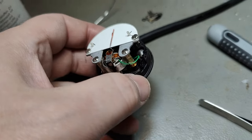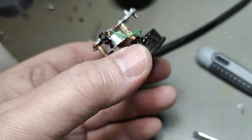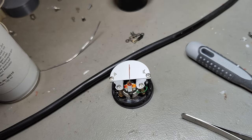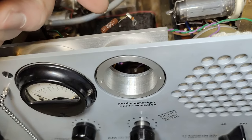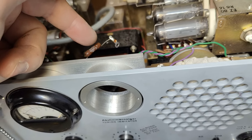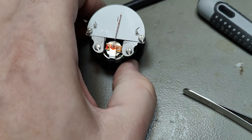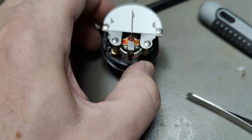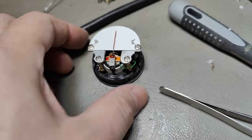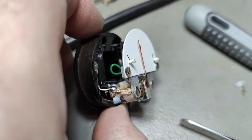It took a few hours but it was definitely a lot of fun. I think I got all the internal parts from the other meter in here. The only thing is that sensitivity is now about three times as low - not a big problem. All I do is change this 100k resistor, because I measured plus minus two volts on that side. So if I change the 100k to 22k I will now get the needed deflection. Oh - look at that, I think it works! I'm probably gonna paint it black or something like the other one.